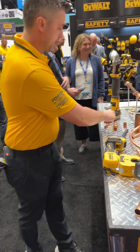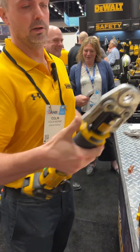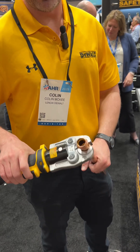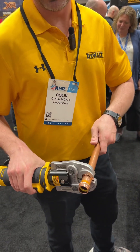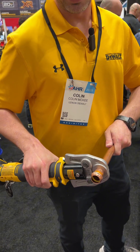Finally, we're going to make our press fitting. We're going to use our DCE210 compact press tool for the three-quarter fitting, with the swiveling head along the lines. Simply put it in, pull the trigger, and you'll make your press connection.